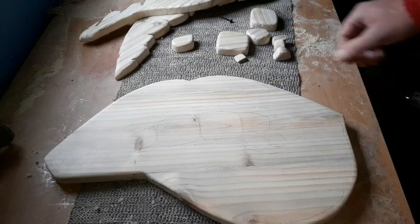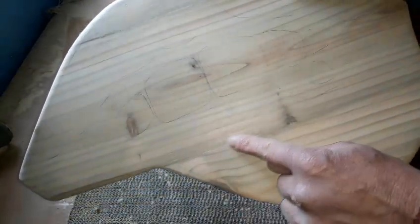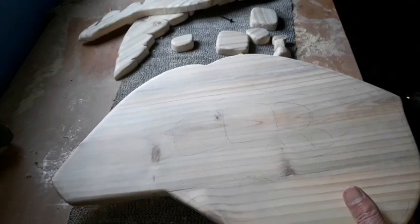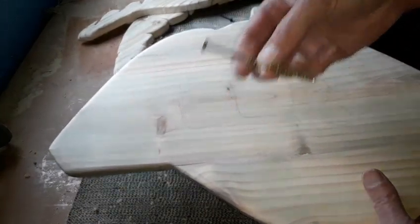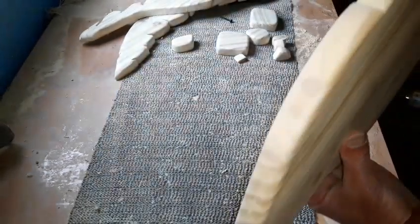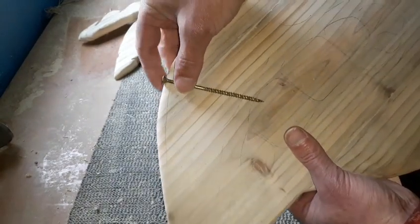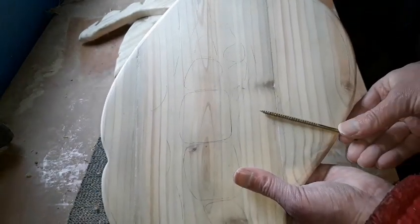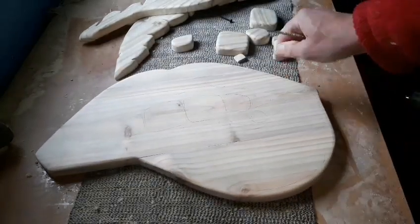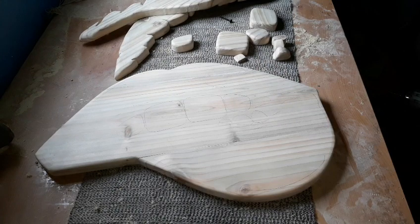Just while I'm on - remember this was made with three bits, you can just about see a line there. This has been glued down plus I found some nice decking screws - a nice long size - and I've actually put screws in the top, just covered over with some wood filler. They've gone right through there to hold that section on, and the same there. We have two at the bottom as well. It seems over the top but it's going to be nice and solid and hopefully it won't go anywhere.